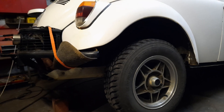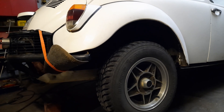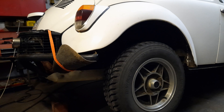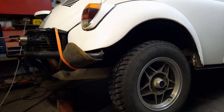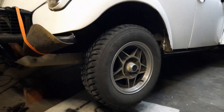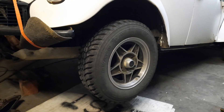I've got a 3,000 kilometre road trip coming up soon, so I may even drop it back down to where it was for that. Depends on how it handles on the road, how it handles at speed, and where it sits when it's all loaded up. Actually, looking at where the shock is now, I don't think I can lower it again. But if I ever have to take it off — to replace the rubber bushes or anything — it'll be easy. In a couple of days we'll have it back on its wheels and see where it actually, truly sits. Thanks for watching. Bye.